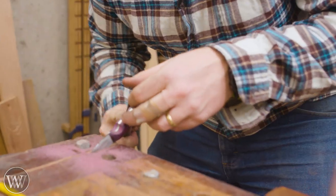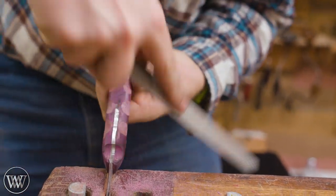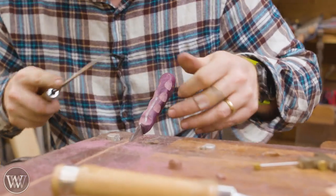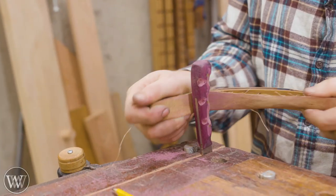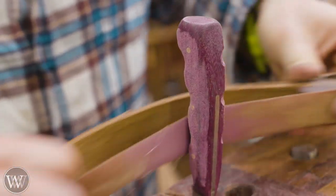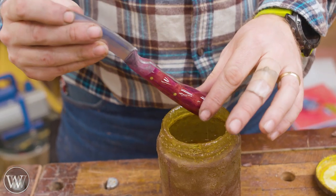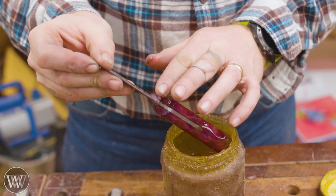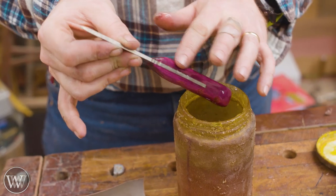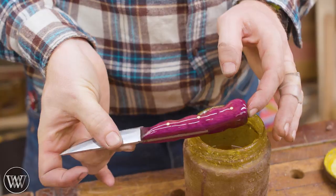Now I want to do a little bit of addition to this. I made the knife handle a little bit proud so I can actually shape it down and make it fit my hand. So I can start with a rasp and lay out where I want my fingers, and come in with a finer file and a finer file until I get to sandpaper. I'll occasionally be grabbing it and just making sure — does this fit my fingers? Is this what I'm looking for? I am really loving the feel of this, especially with the Purple Heart. It just works so well. And then you dip it into boiled linseed oil and it comes out incredibly bright purple. Now it's not going to stay like that — Purple Heart will slowly turn brown over time. There are a few things you can do to keep that color, like a UV poly finish, but most of the time I just like to tone it down a little bit.